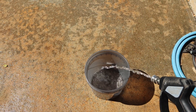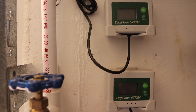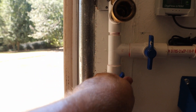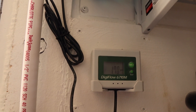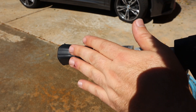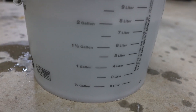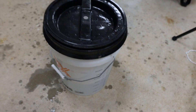That water is nice and clear. I'm just purging straight from the pressure washer, checking to see if there's any air pockets or if it's having a hard time getting this amount of water out — and it's clear. Checking our DigiFlow. Now we'll turn off the DI and just flow straight water to make sure we're getting the same amount of flow — that is exactly what I was doing before, about 950 with this 4.0 nozzle with the pressure washer running. Zero ppm. I did my bucket test and we are dead on at 2.0 gallons per minute, like 1.99. It works — zero ppm and clear. Awesome.